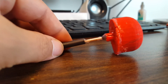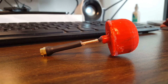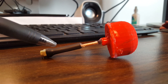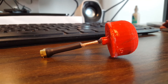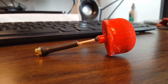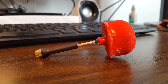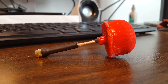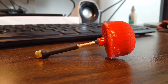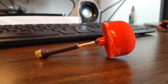The other thing this does is that when you're flying, it's a little stiff and the antenna doesn't bend over as much. I know you can get positionable coax, which has a stiff sheath on the outside, but I actually don't like that stuff because the stiff sheath breaks. It's not made to be repositioned an infinite number of times — it's made to be bent into shape and left there. When you use those for FPV goggles and gear, you bend that coax so many times that it breaks actually much quicker than this stuff. I really don't like it, especially on my copter.